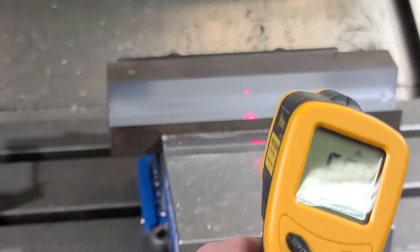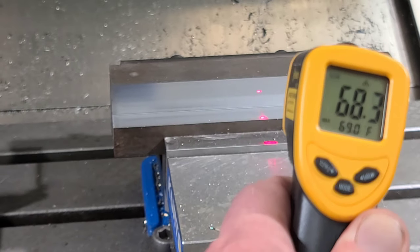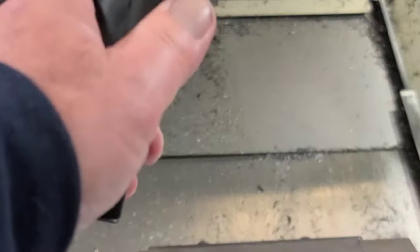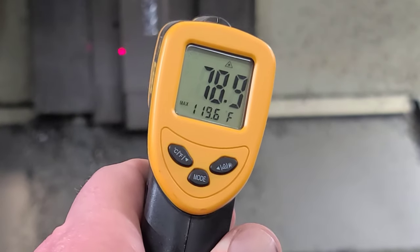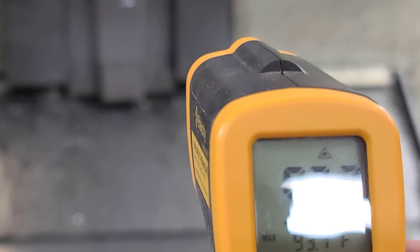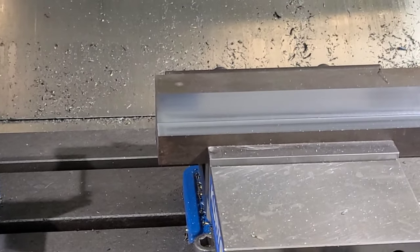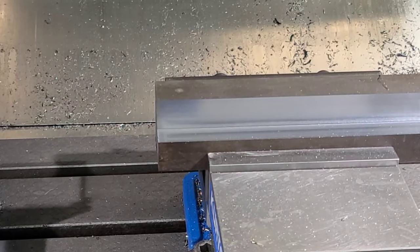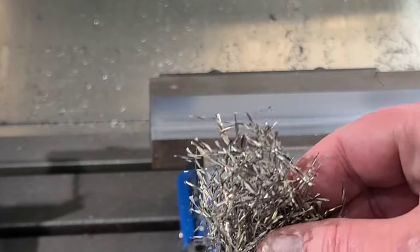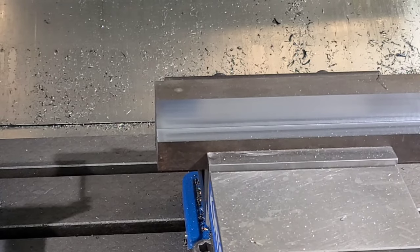Let's take a look at our temperature — as it goes back it's pretty much just a few degrees warmer than when we started. The end mill temperature is going to be quite cool by now. Now the chips — this is basically where the heat went. They're slightly yellowed, and when you see that it means you can be a little more aggressive. You can go higher RPMs; they can start to turn blue, and that's kind of how you want it — a little bit blue. So I could have been more aggressive.